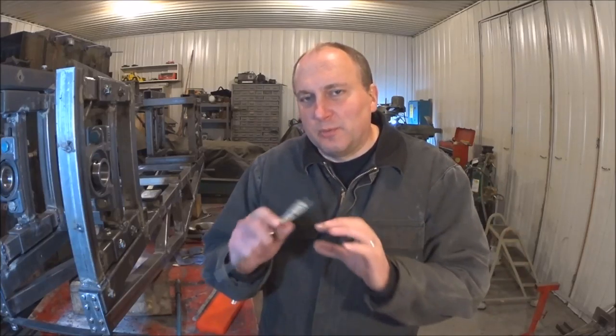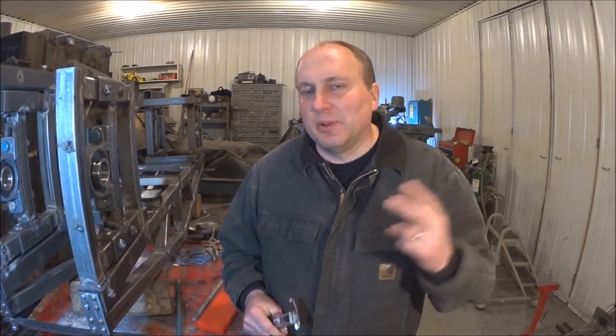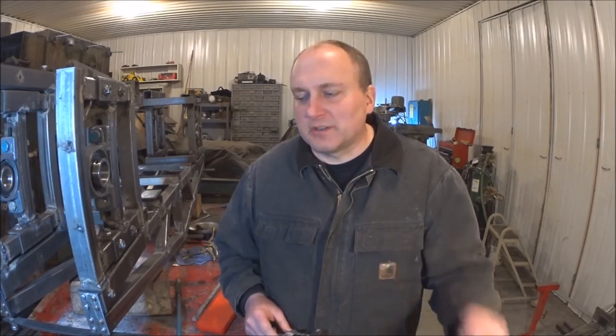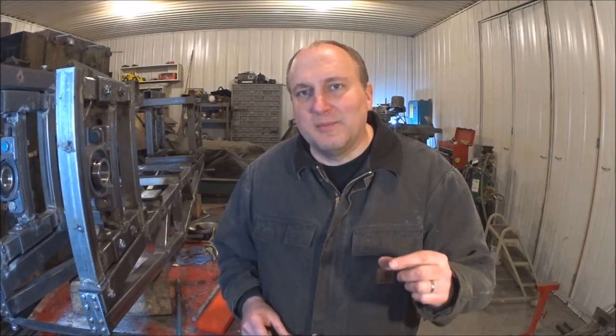So I went from that down to a one inch blade that was 0.035 inches thick. The cross-sectional area went down quite a bit, but I was able to put more tension on the blade and actually got very good results. The blade just plain takes less horsepower. I'm only running an 11-horse motor on the mill, so it's very noticeable that it's cutting easier, taking less of a kerf. That motor can really handle going through the cut much better than the thicker heavier blade.